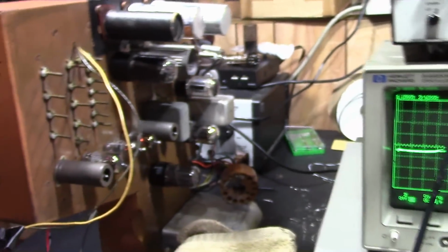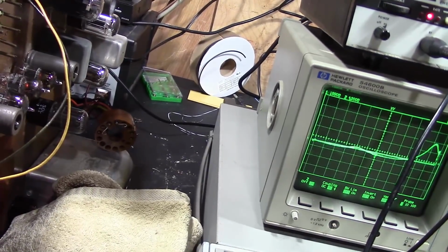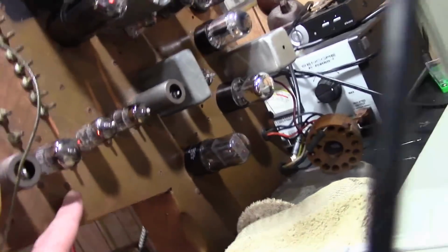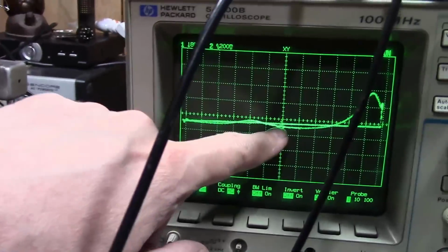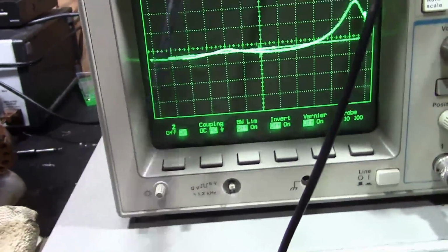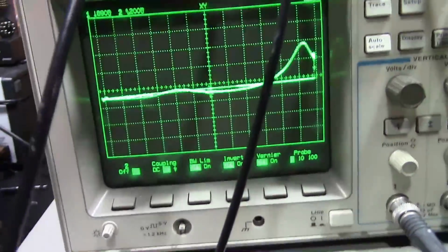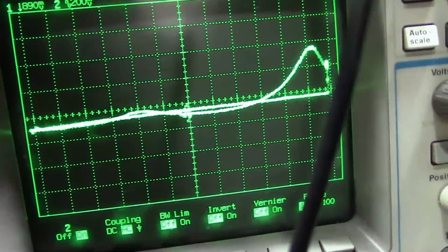So, peaking the first one at 25 megahertz, and that is L36, which is the middle guy. It's this one right here. So, well, I've already got my marker at 25 megahertz, so I want to mess with that coil to see if we can get some kind of response going there. Right now we don't have anything really. It's kind of flatlined at around 25.